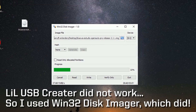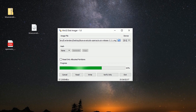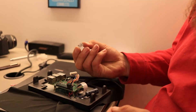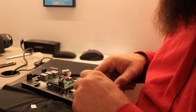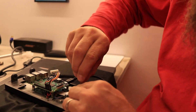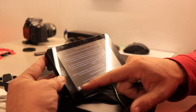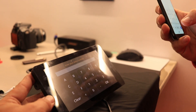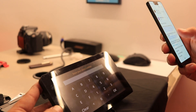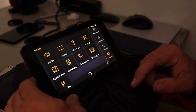It doesn't matter which burn tool you use — there are many out there and I'll put some links to a couple in the description. Once it's done, we just take this SD card, go back to the dash, and plug it in. I brought this whole unit inside because it'll be easier to film. Pop that new SD card in, and it boots up, gives you the terms of service and the don't-use-while-driving notice. With your purchase you get an email with the serial number, and just like that we're into the Open Auto system.